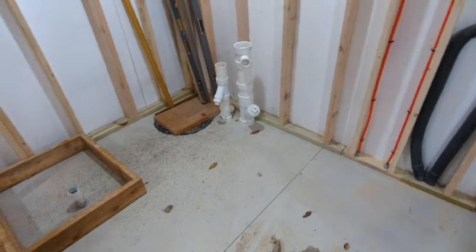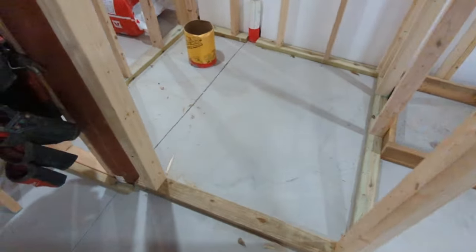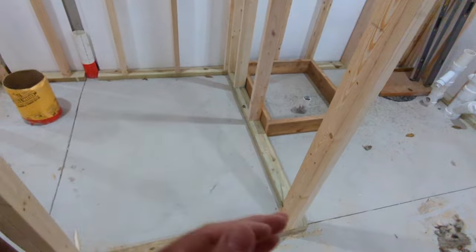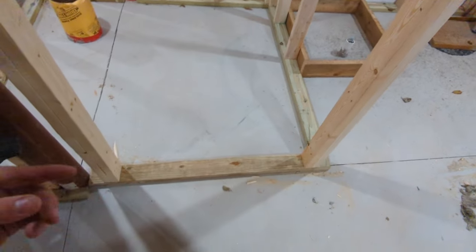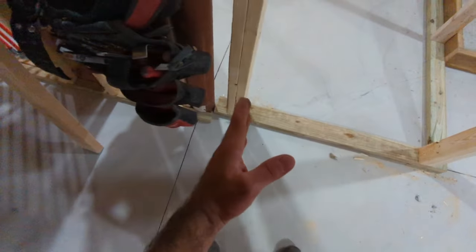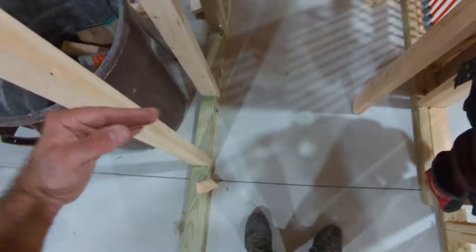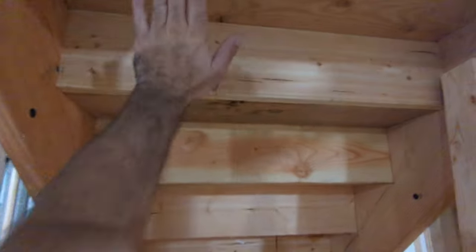They both, everybody does. So, to keep the sink here and the washer here, this is all the bathroom that you can have. If we bevel the door, we can't get around the door, so we bring the room back out to a square. We have to enter a doorway here. It has to be of a certain size, so we can't take off with a wall until we've cleared the door and the trims, which puts this wall here, which means an in-swinging door, left-handed or right, won't miss this, so it'll have to swing out one way or the other, probably this way.